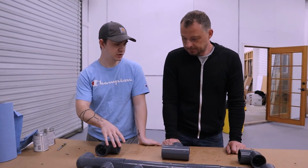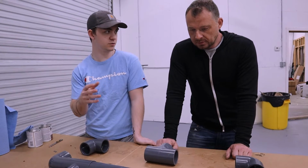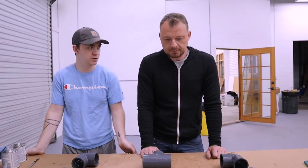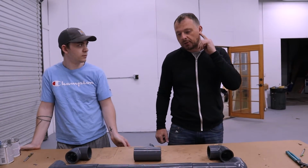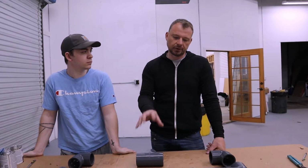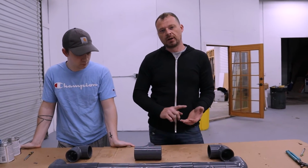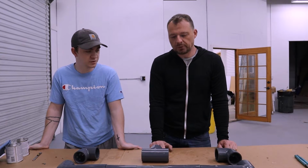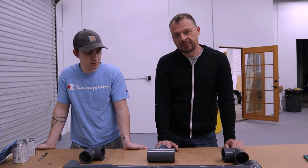Right. And so for this, are we using Schedule 80, or is it just a regular Schedule 40? This is all Schedule 80. So even the pieces in between are going to be Schedule 80 too? All Schedule 80 on these. And I think I mentioned that in the other video. You can get away with Schedule 40 on these. I'm sure they'll hold up fine, but we're doing Schedule 80 just because that's how Rain Deck makes theirs, and you're gonna get high pressure in here, so better safe than sorry. Yeah, better safe than sorry. But if you can't get Schedule 80 in your area, Schedule 40 will work.